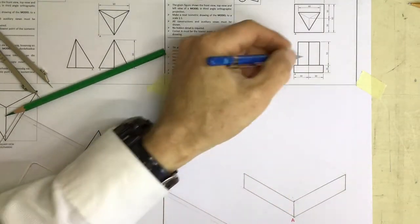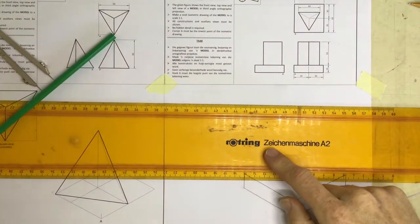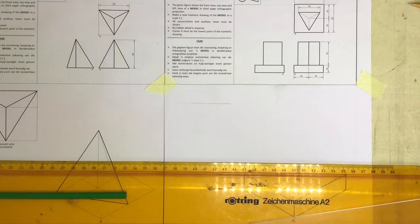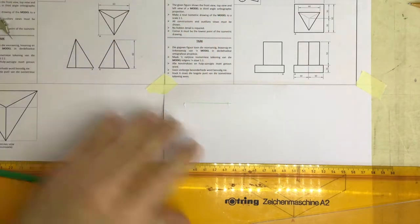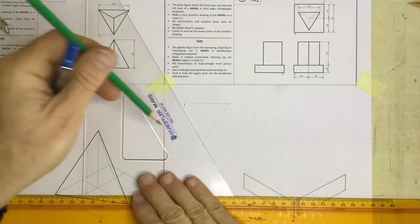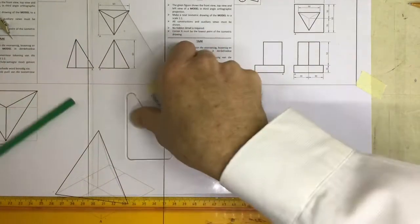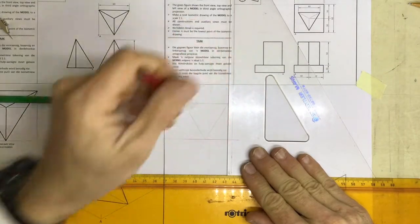The next step is to try and figure out where this triangular prism is going to fit in over here. To do that I need to draw an auxiliary view. So I'm going to find out what the length of that side is — it says it's 44 millimeters. I'm going to come up here and draw a little auxiliary view, draw a little construction line there, and measure off 44 millimeters. Mark that on my construction line over there and over there. Once I've got that in place I can then draw in construction lines coming down over here and over there. There is my view of the triangle that I need, and after I've done that I'm going to draw a line coming out like that and a line going back like that.